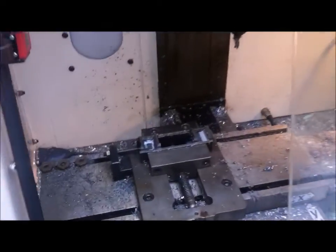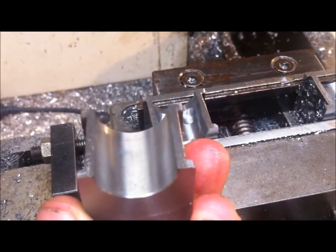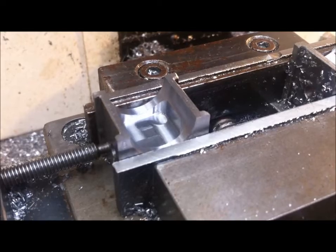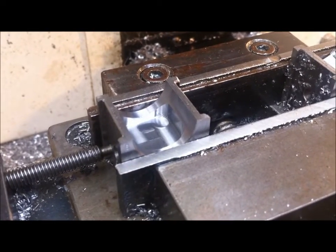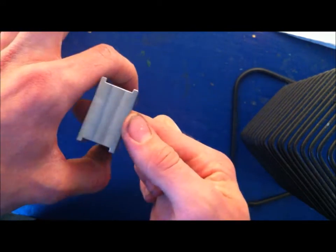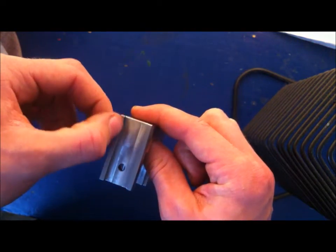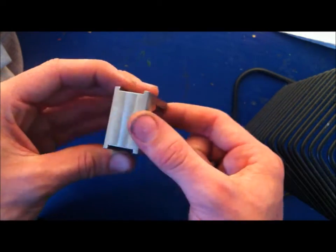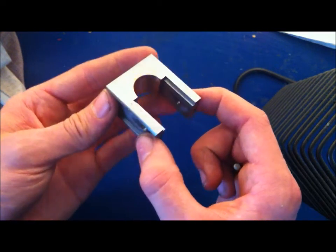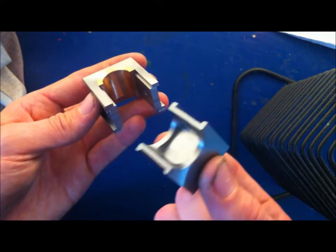I'm out here at the Boxford CNC mill producing the final feature, which is an oil well in the bottom of these under-keeps. So time for final assembly when these are done. These are now finished, or as finished as they're going to be for a while. In the end I'll run in a slot, and when I finish the slot I'll need to do a few fitting jobs such as putting a bit of a curve on these lips to allow some movement. I'm pretty pleased with how they've come out. That's the main body with the bronze bearing visible, and underneath slides the under-keep.